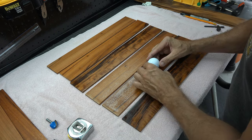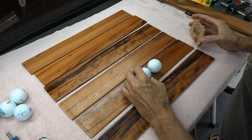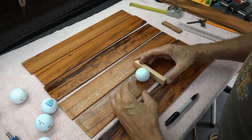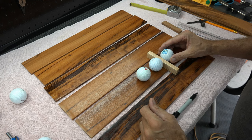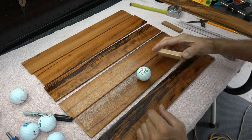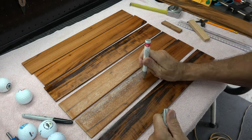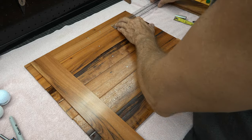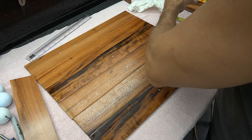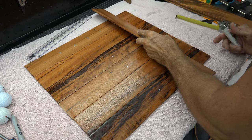At this point I am trying to find out what would look best for ball spacing. I start by finding the center of the board and then using a piece of scrap wood, I place balls on to see what distance between them looks best. My third attempt gave me my best spacing, so I mark under the first and second ball, get the exact measurement between the two, and continue that out to the last ball. If you are following along, you get to learn from my mistakes. At this point you need to make all of these shelves a quarter of an inch shorter in width — I completely forgot to do this. This is so your back plate sets into the frame. I don't edit out my mistakes, and I got caught up trying to make the balls look best so I wasn't paying attention. I will show you when I realize I screwed up later in the video and how I fixed it.